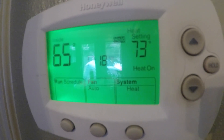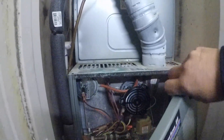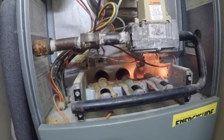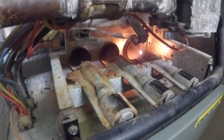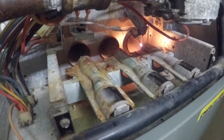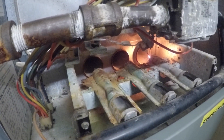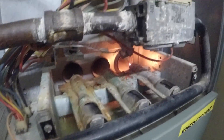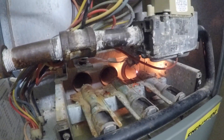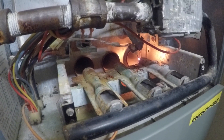I came to my brother-in-law's house and we tried to turn the heat on and it didn't work. Last year around this time I fixed this one by replacing the inducer. So this is what it does — it doesn't turn on at all, only the fan and the blower inducer motor are working.